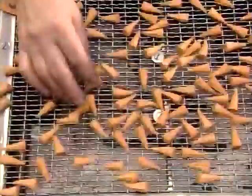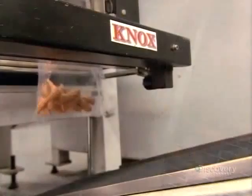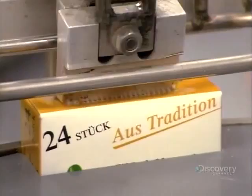The cones now bounce along a conveyor past an inspector who sorts out any defective ones. The good ones move forward and tumble down a chute, landing in a plastic bag, and a device moves in to heat seal it. An automated counter overhead portions out the cones to ensure the correct number is deposited in each package. After a worker puts the bag in a box, an automated device folds down the lid. From start to finish, it takes about 14 days to produce a package of incense cones.